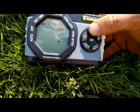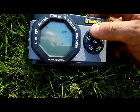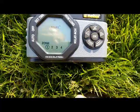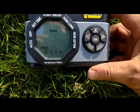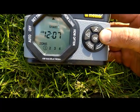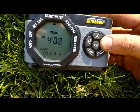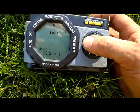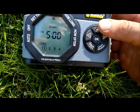This top button moves our selector around the controller. Press the center top button and now see how zone 1 is circled — we're now programming zone 1. Hit the plus sign to set the start time. For this home they take showers in the morning, so we're going to avoid irrigation during the hours they might take a shower. We're setting 5 a.m. for the first zone.